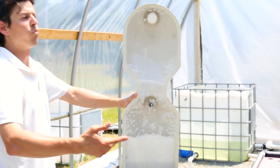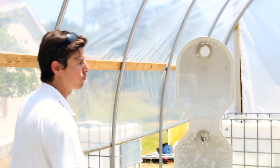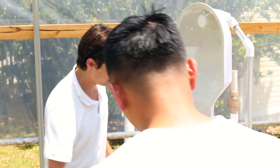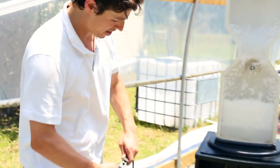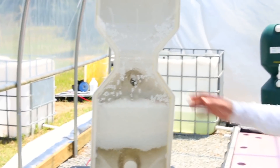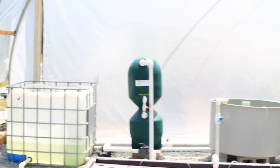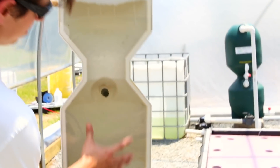The backwash isn't complete yet — we're 50% of the way finished. Now we reverse those steps and we're flowing again. The process takes anywhere from two to three minutes, very simple, very quick. I'll spin my three-way valve back to the starting position and plug the water pump back in — filling back up. With this system you can clean your water in a couple of minutes, two or three easy steps. Now solids are getting captured again on the beads.